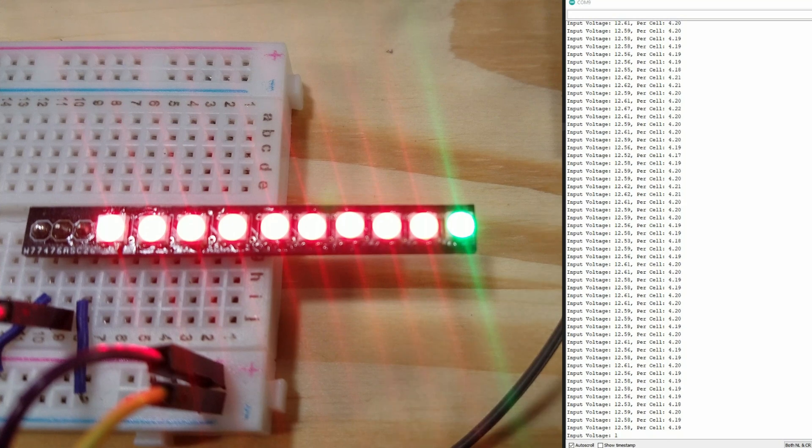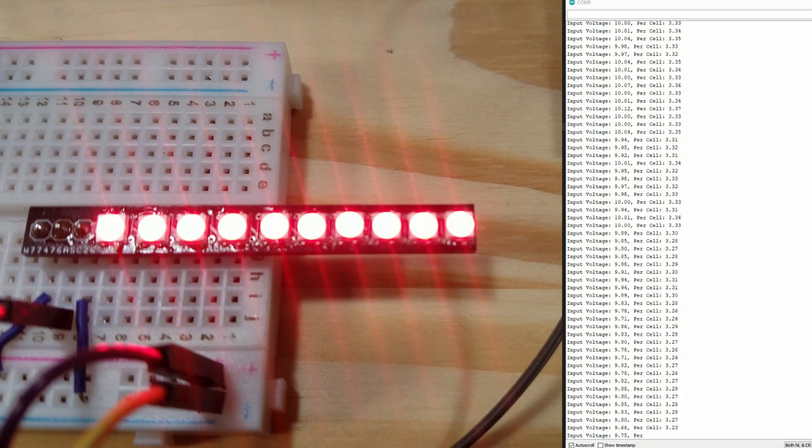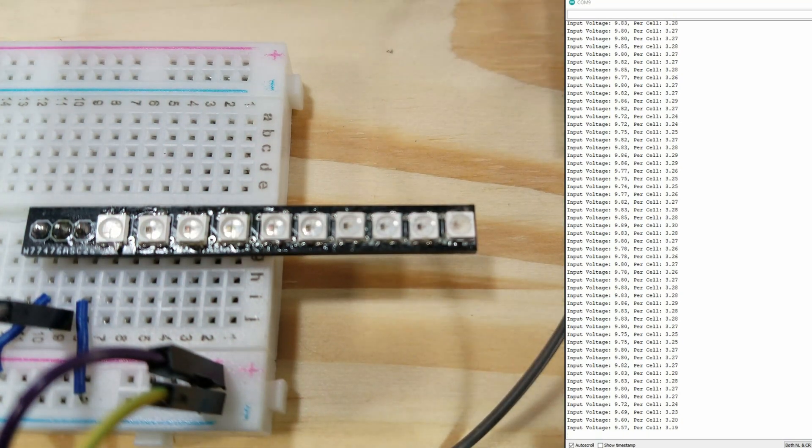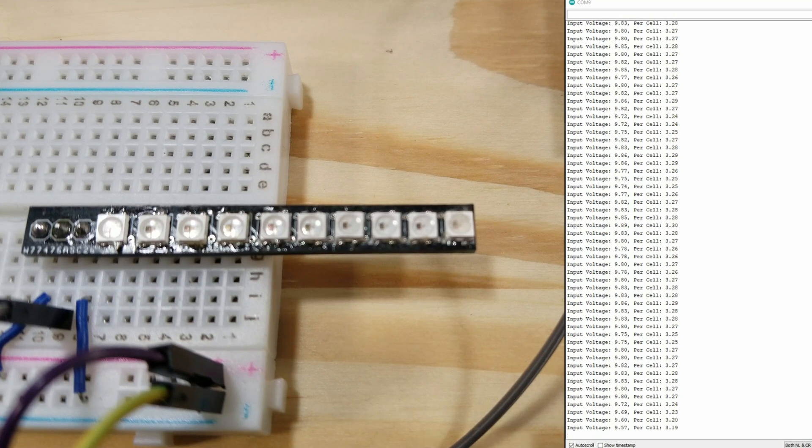The light is green when the battery is fully charged at 12.6 volts and it stays that way all the way down to the nominal charge of 11.1 volts. If we get below that it'll change to yellow, staying yellow between 11.1 and 10.2 volts. Below that it turns orange, and below 9.9 volts — which is 3.3 volts per cell — it turns red. If I keep spinning past 9.9 and get below 9.6, the Arduino shuts off entirely: it cuts power to the motor and to the lights, and I can't get it working again without rebooting or recharging. It's a good safety feature that can lengthen battery life and keep them from getting too discharged.